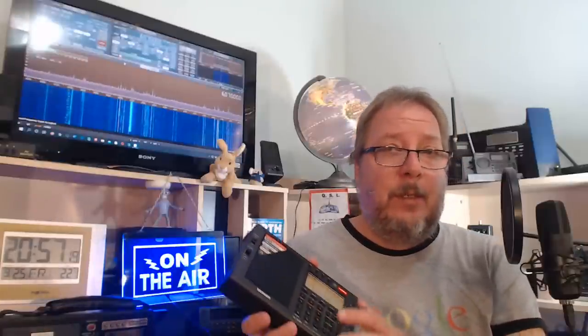I haven't looked at all these settings live yet. One of the things that I will be looking at, because when you tune on single sideband, one of the interesting aspects is that it's extremely precise. Most radios that I purchased lately, this one is off by 1 kilohertz, but it's still precise when you tune a signal in sideband. One of the problems that I have with the XH Data D808 is the same problem on the C-Crane CC Skywave SSB. That is the same problem on the Eton Executive Satellite SSB.